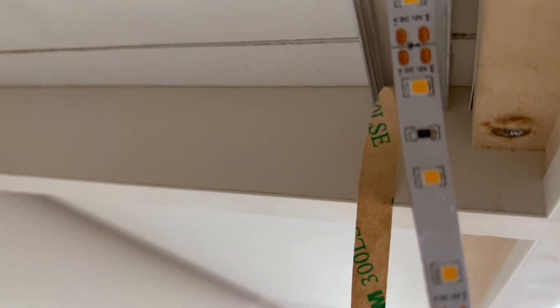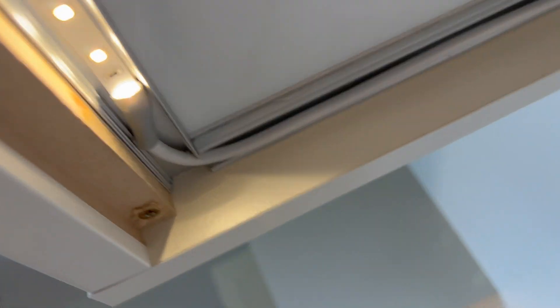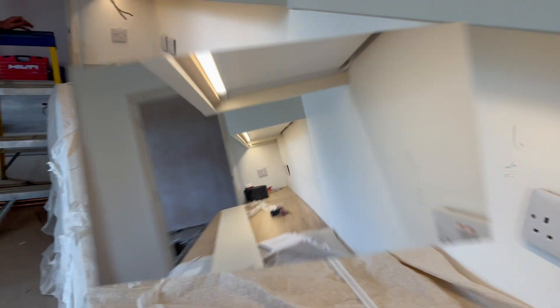Ebbs has just come in to help because it's raining. See that bit where it's cut — that's where he's got to cut it. He's a little bit short of the edge but that's not too bad. You can't do a lot about that — you've got to cut it there. That's where chip-on-board stuff is better because you've got more spacing to cut it, whereas on this one it's about every two inches. It comes into the corner and you don't really notice it. We tape it up and then lid it, and that's what that dummy bit is so it looks neat.